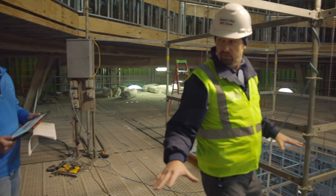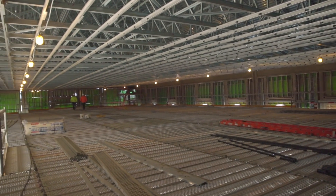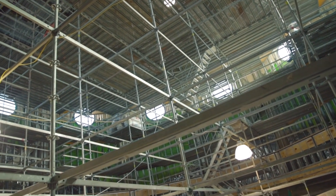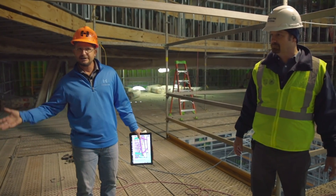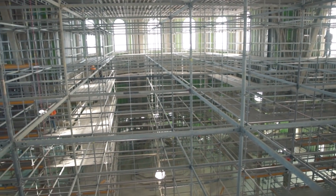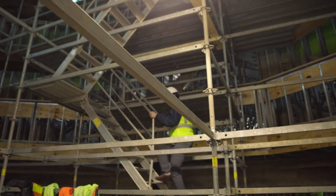Now we're up at that 54-foot level. We basically have this entire space as platforms — we're about eight feet from the ceiling. We've got beams that come down about two feet. A building that's this tall on the inside, you get outside of anything you can do for lifts, so it all has to be something you can get a person to reach off of this scaffold. Our main ceiling elevations — through the nave, the transepts, and into the sanctuary — will all be done off of this. You can also see that we have working platforms all the way down the perimeter. This scaffold system really has to get a person's hands to the finish space all the way around. Let's go up into the cupola on that deck and talk about our strategy for what's going to happen here over the next 12 months.